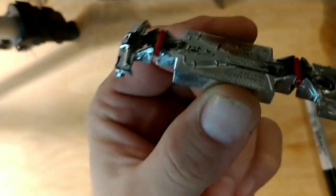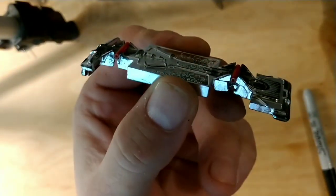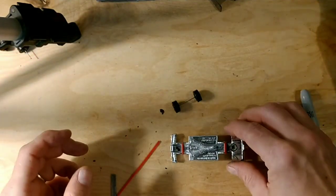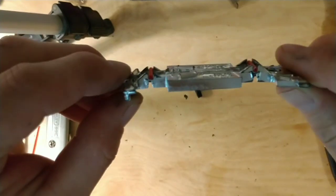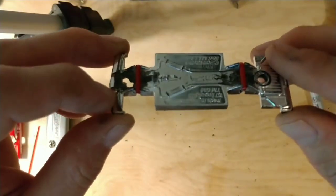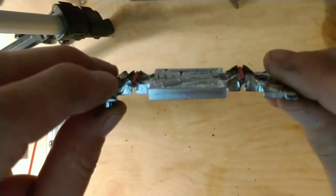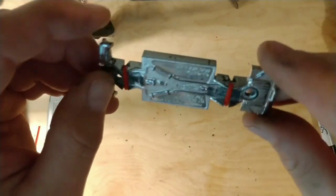All we've got to do now is apply some glue to hold them in place, making sure not to get any glue in the holes that we're going to insert the metal rod through. In fact, if you can get these to fit in here tightly without glue, I wouldn't glue them yet. We'll go ahead and cut our axle and place the wheels on here and do a dry run and make sure everything's square and nothing needs adjusted before we apply any glue.